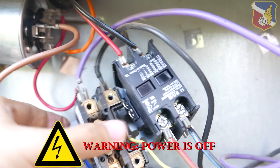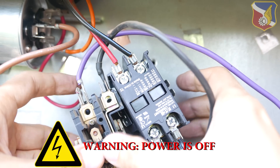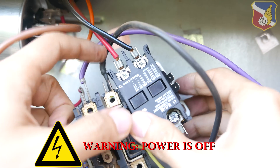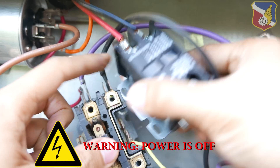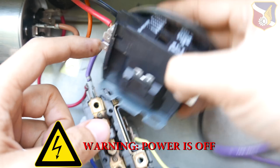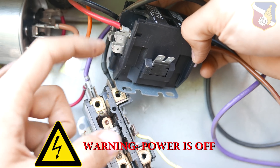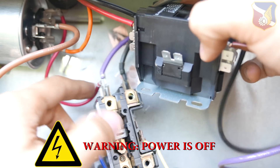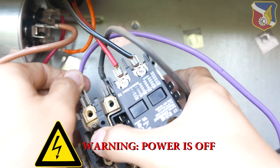After moving all of that, on this side I have a red wire and a purple wire. I need to go from T2 to that T2. On this T2 there are four terminals — one, two, three, four — and it doesn't matter which terminal I plug them into, as long as it goes from this T2 to that T2.